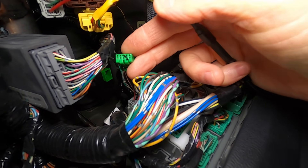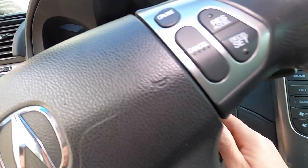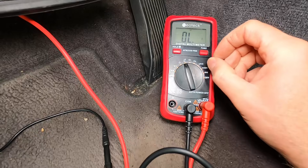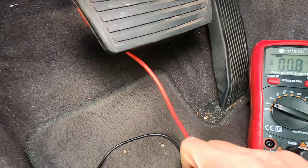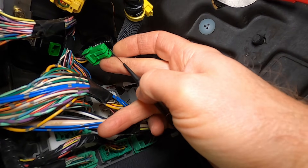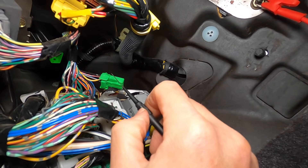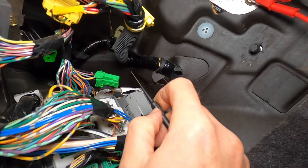Let's check the power wire — that's the third one, looks like right here. We need to turn on the ignition key. Now on the multimeter, switching to volts DC, we should see battery voltage at that yellow wire. And we have 12 volts — that is fantastic. If you do not see a reading here, then most likely you have a blown fuse.